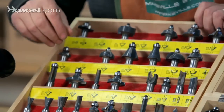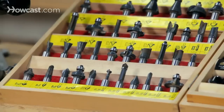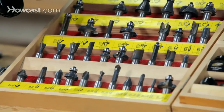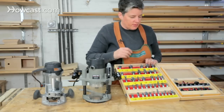There's a whole category of joinery cutting bits as well. The most common is a straight cutting bit like this, which makes a straight slot. But you'll also see bits that create wedge-shaped slots or dovetails, and there's a whole variety of other ones as well.